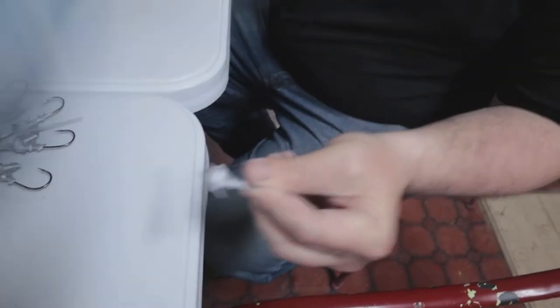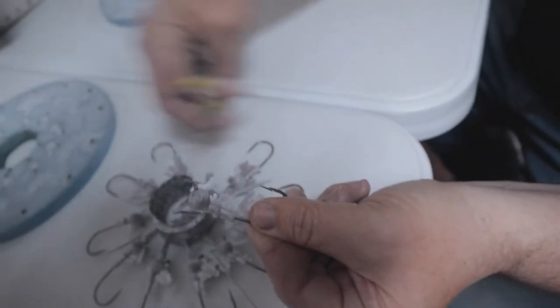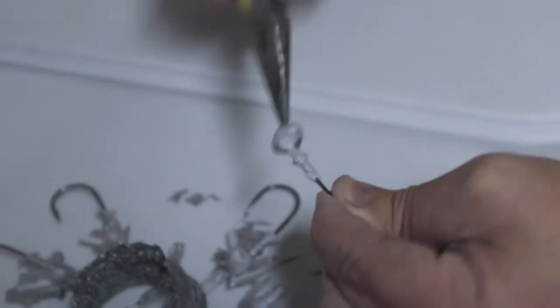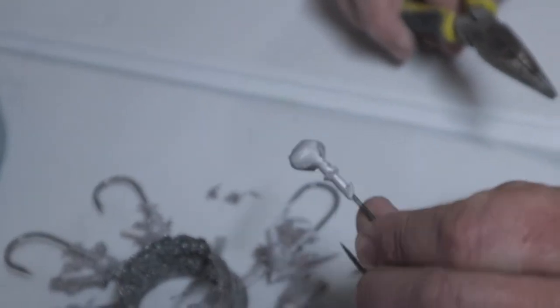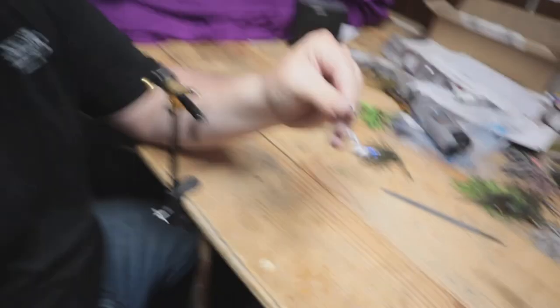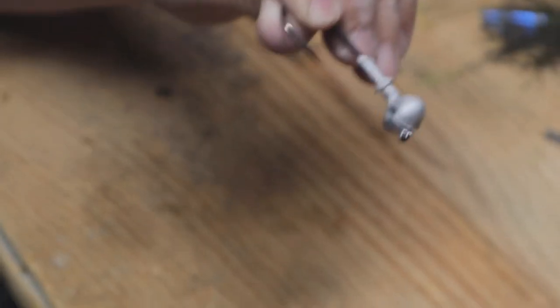These are not too hot to touch — three minutes later and they went from 850 degrees to normal room temperature. I take the Teflon out, pull it right out, and use my needle-nose pliers to pull all the little flashing off. Sometimes lead gets in the eye — I've got a drill, a 1/16-inch bit, and I drill through there to clean the eye out. We've got 10 jigs in this mold, so we're going to clean these up and get them rolling.